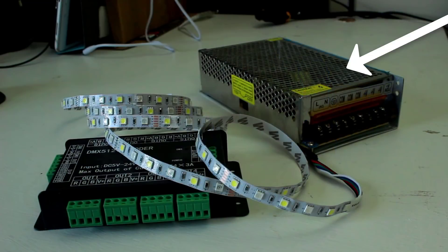You're also going to need a power supply. You'll need to calculate how much power your LEDs are going to take and then size your power supply appropriately. If you pick a power supply that's too big, that's really not going to be a problem, so I recommend always aiming just a little bit high so that you have a little breathing room.